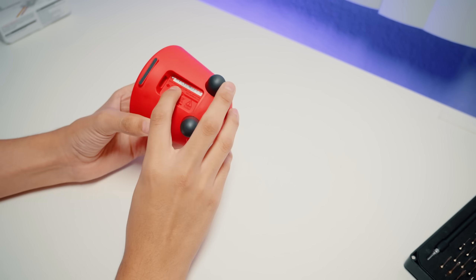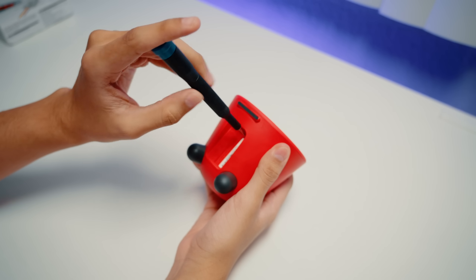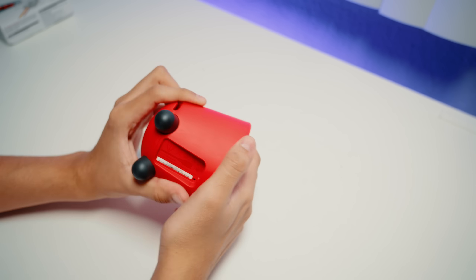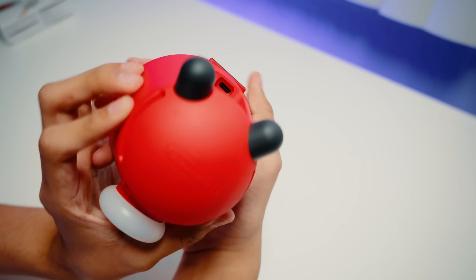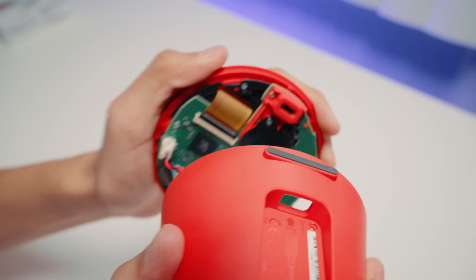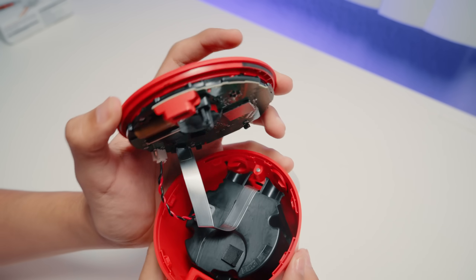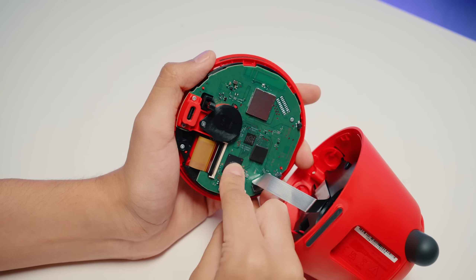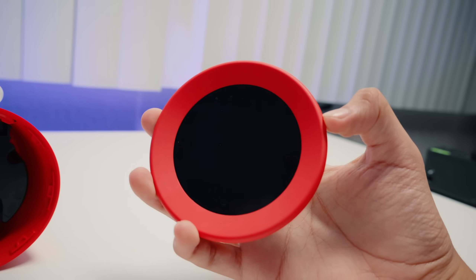I see a single Y-triple-zero screw in the bottom. I'm going to try taking a look at that and see if it does anything. That screw is the only thing that holds this whole thing in place, and with a little twist it just opens up. And we can see the insides now — just two cables holding the screen. Once that's off, we can take a good look at the board. What we're really interested in are these debug pins right here.